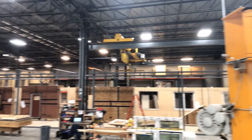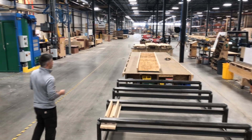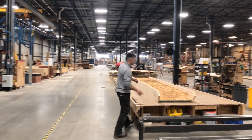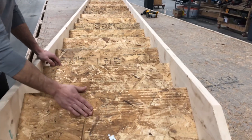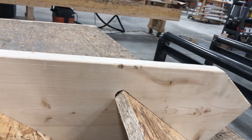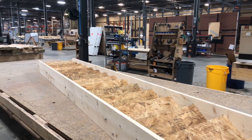Before this station would be the framing of that panel, and it's a lot like the framing you saw on the roof panel. Here is another crucial part of our raising during the floor assembly — our site construction stairs. We just need these to walk up and down between floors, but it's a huge benefit. We do mortise and tenon joinery with the actual stairs — everything is designed in CAD, spit out on the CNC machine, then just bolted together. It can come back home with us by unbolting, or it can stay whole. It's a huge benefit rather than carrying ladders all over the job site.